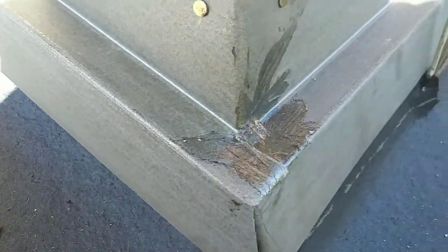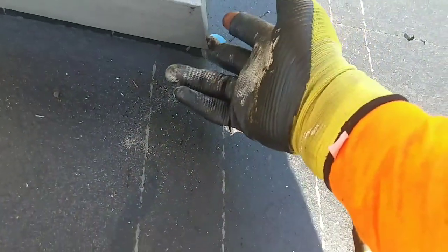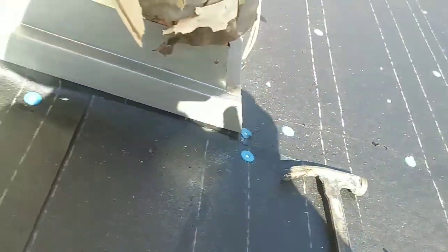It's clear. So make sure underneath this one there's a lot of caulking, because this tile is gonna finish right here. So if some water goes, the paper is gonna go on top of this. So if water runs behind this tile, it's gonna run over here. It's gonna find its way inside there. Make sure everything is waterproof. And then later on, I'm gonna waterproof the metal that goes here. Okay.